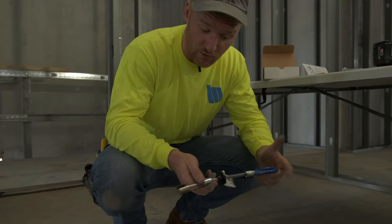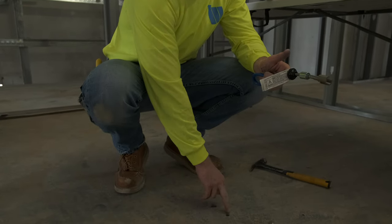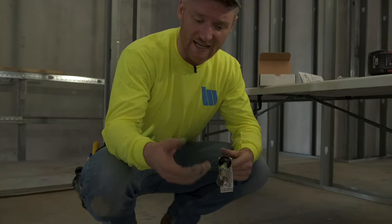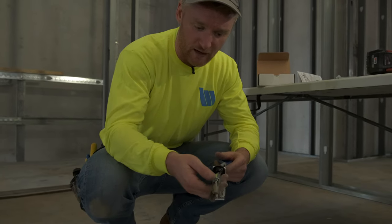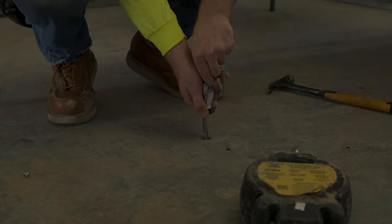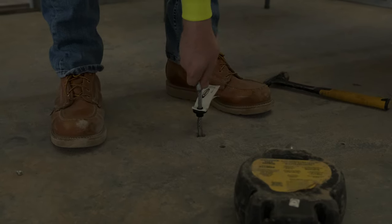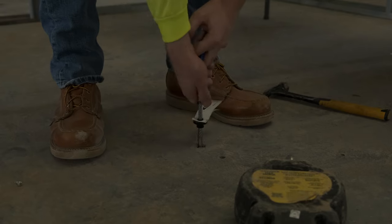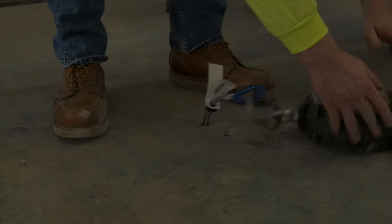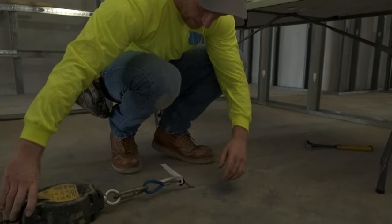This is the other anchor — the Werner — and I thought this one was really cool just because it's reusable and removable. We were able to pull the sleeve from this one, so it's nice that you can just pull that sleeve and don't have anything to go grind off. This one has its own expansion anchor built in through the mechanics. We've already drilled our three-quarter-inch hole — I'm going to push this in there at a depth of about four inches, let this pulley system retract and set, and it's wedged in there. Then we can connect our retractable to it, and as long as we're unobscured by anything, this will hold.